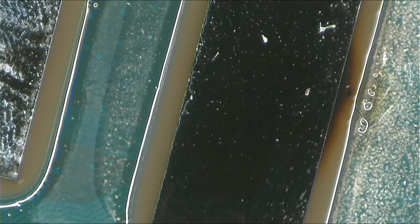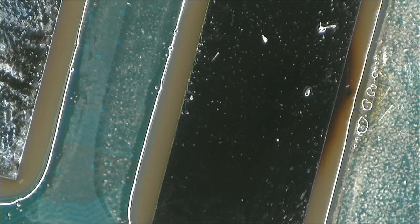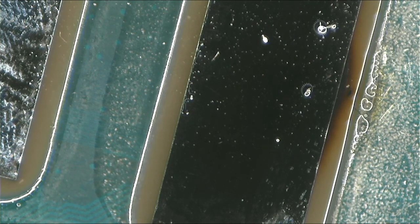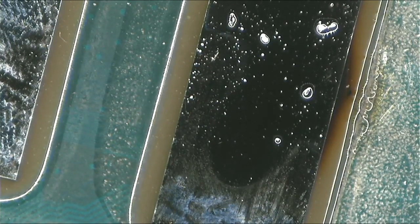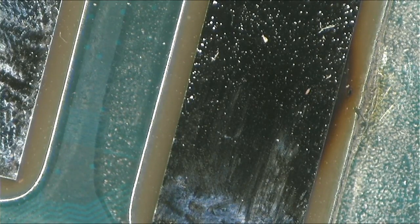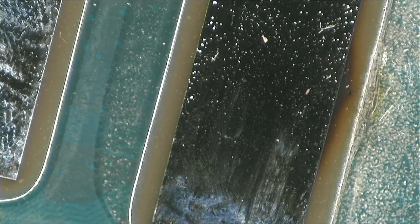When you have a short on the 3.3 volt rail, be very careful, because sometimes the short might come from the PCH. I don't like what they did here — even if you have a stencil and a reballing machine, it's going to be hard, because you have to buy the whole CPU just for one shorted PCH. I hope you are learning — there was a big lesson in this video. Don't forget to press the like button and subscribe.